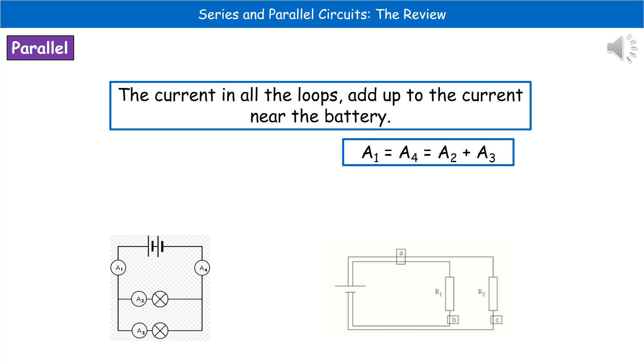The second kind of circuit we could have is a parallel circuit. These have a very key difference from series circuits when we look at the readings for current. In the bottom left, there's a circuit diagram for a typical parallel circuit with two lamps and a battery, and four different ammeter positions: A1, A2, A3, and A4. Comparing the readings, A1 is the same as A4. If you add A2 and A3 together, that total will be the same as either A1 or A4.